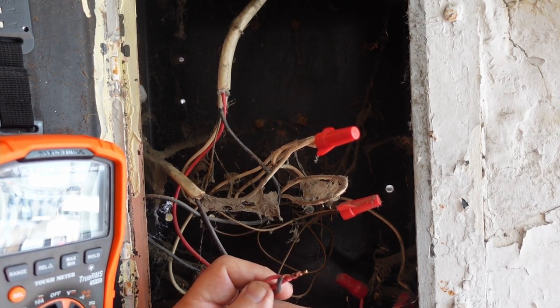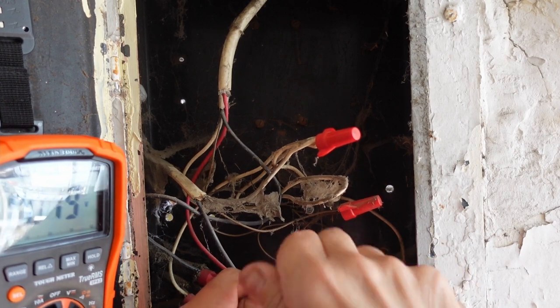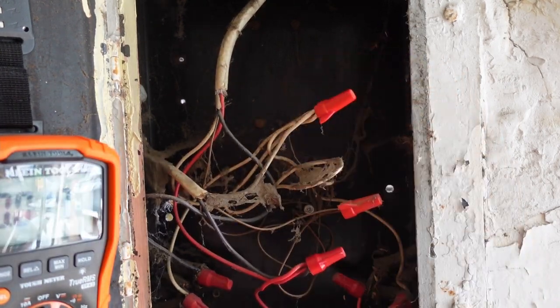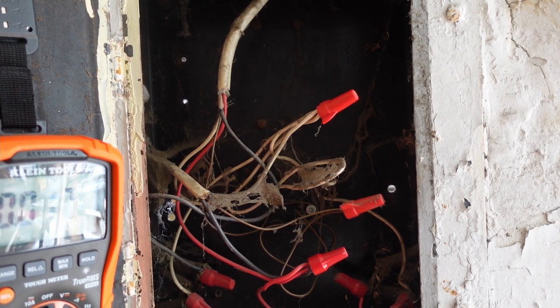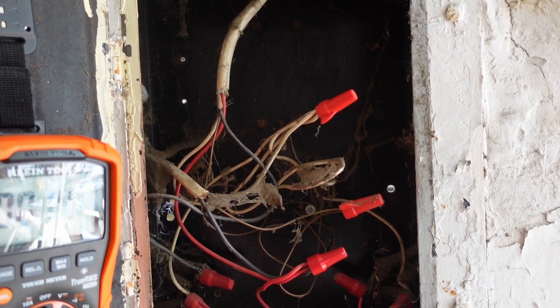What I did is I just moved the wire up a little bit and I am now tightening down the wire nut to make sure that it has a good connection. The light is now on. I'm going to go check a couple of the other lights to make sure they are working — and yes, that does fix the problem with the other lights. I'm going to take this one apart again and put the switch back in because I don't like working on live circuits.